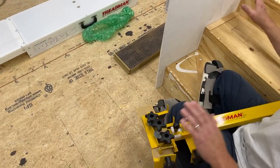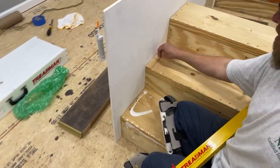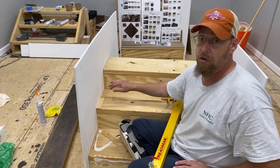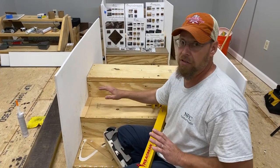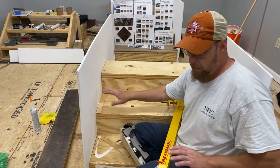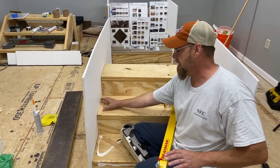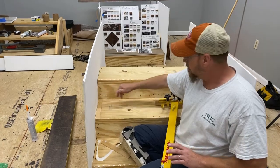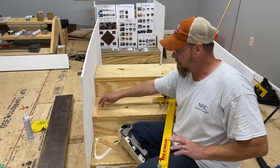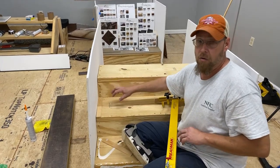This will actually concave to those perfect little angles or curves in your wall. A lot of people will use a miter saw or a table saw, but if you're doing a vinyl plank and you've got a crook like that in the side of your step, you're going to want to use your knife, score it and snap it, and it's going to snap off right perfect with that curve. I'm going to set up a couple pieces, set this jig up on this step — this one in particular because it does have that crooked spot — and we're going to cut a couple pieces of vinyl plank.